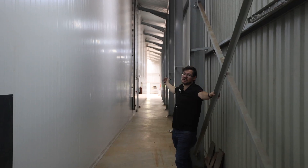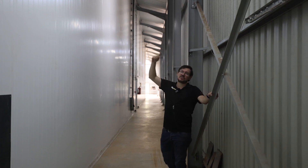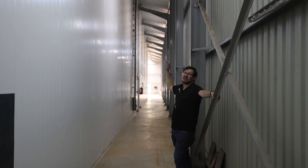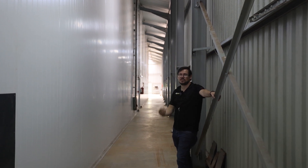Over there we've got a fresh air inlet. All the fresh air used to dry the nuts comes down through that overhead door into that inlet, runs along the ceiling, gets heated up to about 60 to 70 degrees, and then goes into the drying room where we use that hot air to dry the nuts.